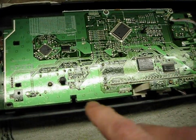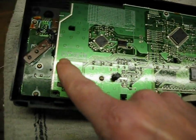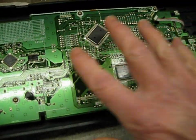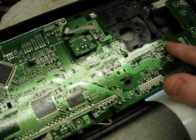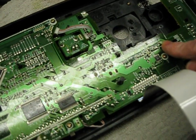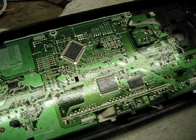Okay, it's all reassembled. Just to warn you before you put your four screws back in — you've got a connector there, connector there, connector there that go down to the boards underneath. This one over here didn't want to line up for me, so before you go forcing anything to snap down, just make sure all those are seated. I wound up loosening up this board a little bit and jogging it a bit until this seated in place. Then all my little square snaps fit into place and I was able to put the screws in.